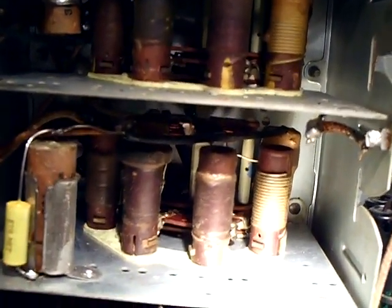I was looking at this coil back in here - you can see the one where my finger is to the right of this resistor. I put some clear GE silicone on there because it was bumped. When I looked at it, it seemed like it was bumped during assembly - the coil looked a little smashed and the wax was kind of crumbled around there. I think they let it go because it was probably still working, but it was hit during assembly.